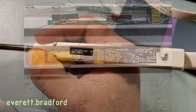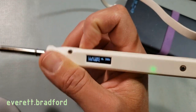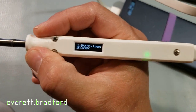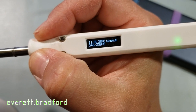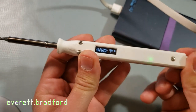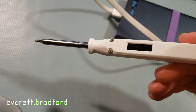The iron includes a tilt switch to detect inactivity and shut off, and it has a basic UI using two momentary switches which adjust the temperature set point. All the relevant settings and data are displayed on a small 96 by 16 pixel OLED display, much like the TS-100. The housing is 3D printed in ABS, and it has an internal temperature sensor which will allow it to self-protect if the case temperature gets too high.